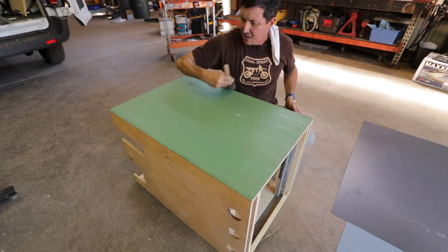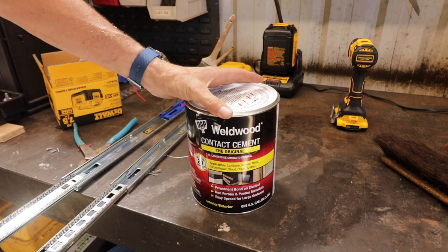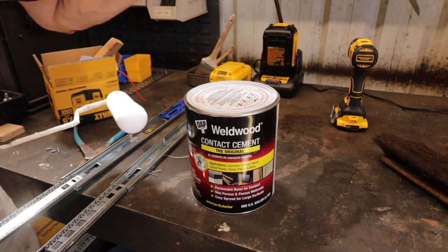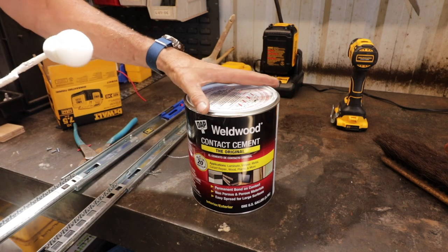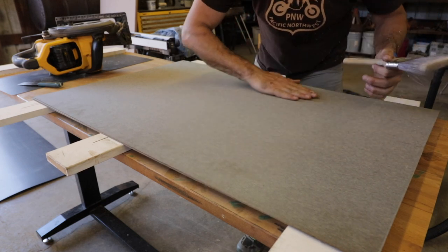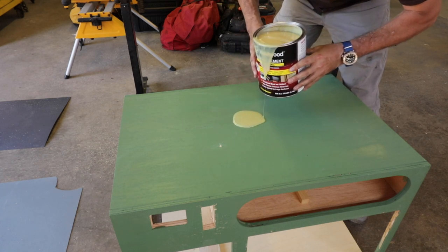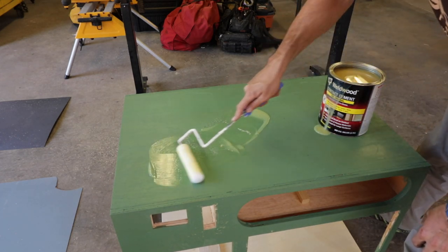Make sure we're clean and dry, and now we're going to use our regular old school contact cement — just regular contact cement, about a gallon. We're going to apply it with a foam roller. You apply it on both sides and test it until there's no longer any tackiness, until it doesn't stick, and then we'll put it down — because once it comes in contact, once it sticks, you'll never move it. Our piece just has to be absolutely clean — no goobers, no pieces of sawdust. Make sure you cover the whole thing with your hands because you can feel what you can't see. I'll just pour a little on and smear it around until it coats.